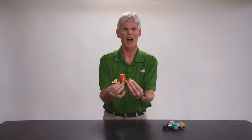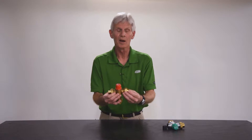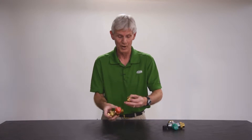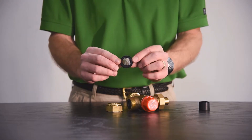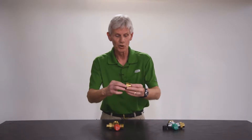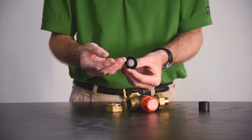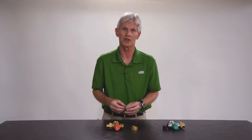What I've got here is a typical high temperature TMV — it'd be used in radiant floor heating. If it doesn't work correctly and starts to not give you the flow rate that you need, that could be because the internal screens are plugged. On the inlet to both the hot and the cold, we have cone strainers inside. If the flow rate coming out of the valve starts to diminish, you can disconnect your unions, pull out the cone strainer, and thoroughly clean that screen. Any debris on there is going to be an impediment to flow, so that's something you can service on a thermostatic mixing valve.